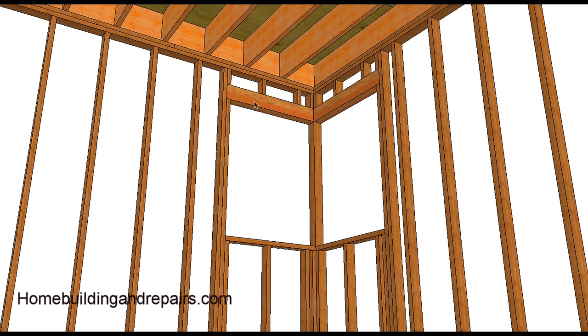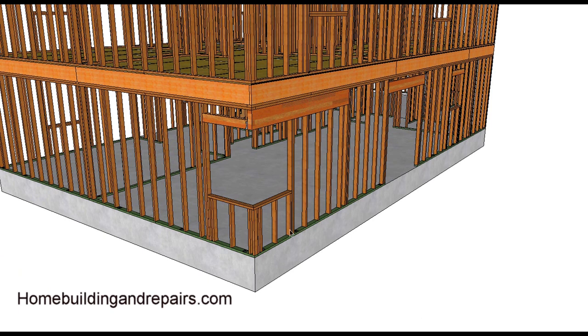Here we have regular standard construction with mitered corners. If we remove the post we'd probably have some problems, but there's your solution right there. It looks a little bulky, but this is normally how it's done — you put a beam in there for your window header. I just made this one go all the way to the top.